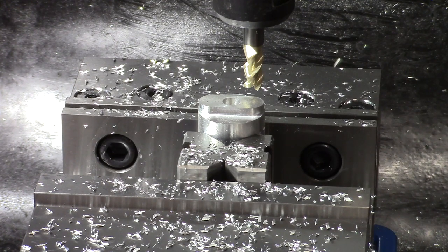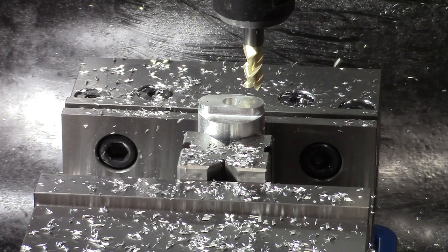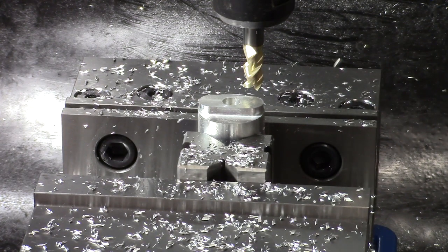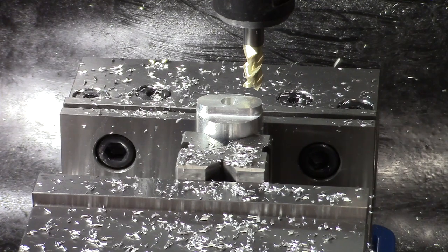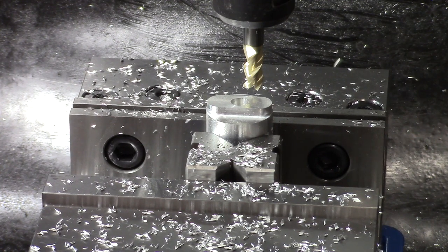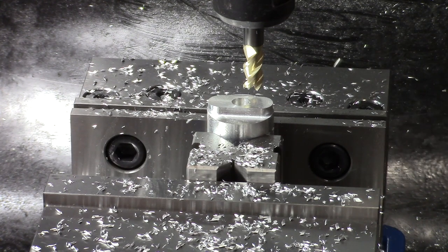So that was pretty much the 350 thousandths I offset it. Oh, we need half of that. So if we divide that by half, we have 180 offset, so 180.1805. So I offset twice as much as I needed to, so that's okay. In this case, that's fine. So instead of 350, we're going to go back down here to 0.180. Four, which is as close as we can get.